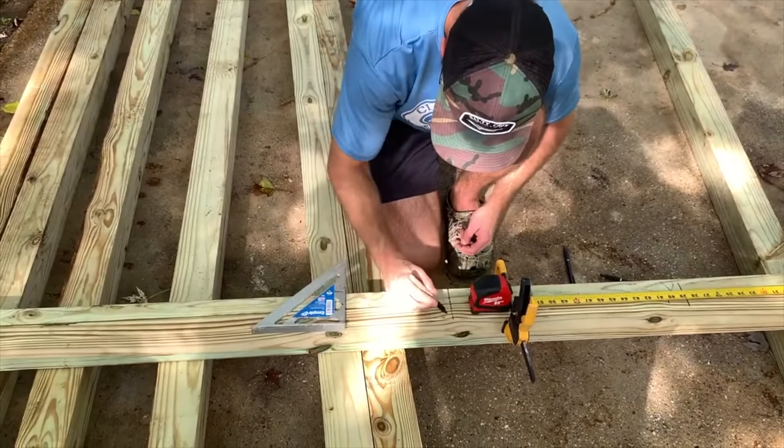Now we're gonna install that partial sheet. Again, we're gonna cut that piece of panel to size using a circular saw. Keep track of the underlap and overlap edges when you're cutting so you don't make a mistake. Now we're moving over to the final sidewall. As you can see, we marked the window penetration again and we're doing the plunge cuts just like we did on the first sidewall. And then we're gonna use the jigsaw to clean everything up.